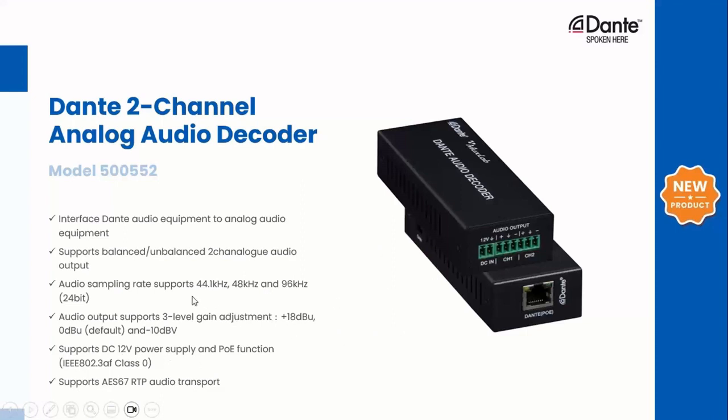Here again, we have the same sample rates, so we support 44.1K, 48K, and 96K at up to 24-bit. This product and the previous product both support balanced and unbalanced analog audio, depending on what you're working with. You have the same gain controls as well, so you can output at plus 18 dBu or 0 dBu for professional applications and minus 10 dBV for commercial applications. Again, you can power via a 12-volt power supply or PoE, so you can draw power from the Ethernet switch, and it does support AES67 RTP audio transport as well.